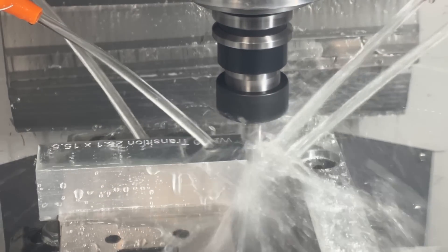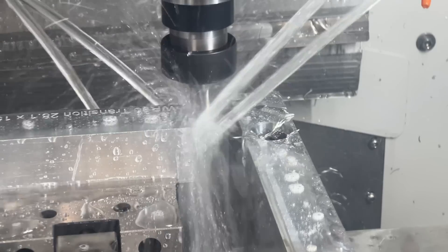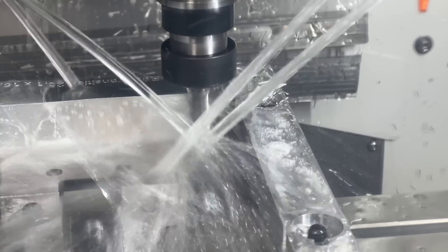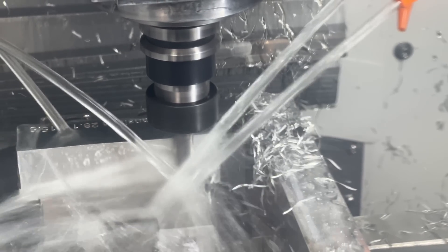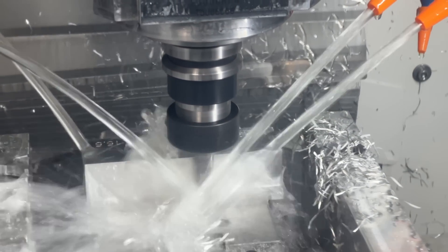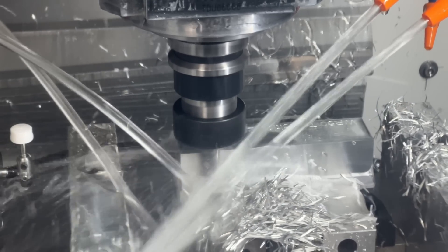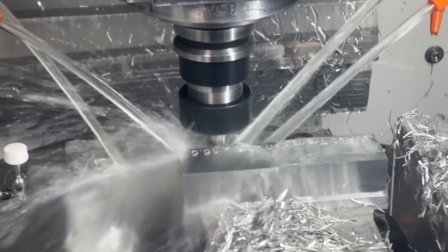So now it's time to do the top, bottom and ends. For some reason I didn't do it all as a single operation. I think I had at the back of my mind that it would take too long and it would be cutting a lot of air down the sides, because there was more waste on the ends of the stock. The end result was that I've got a small burr on some of the corners — hardly a problem though.